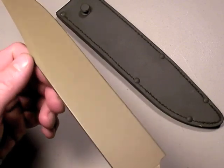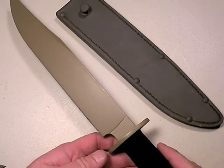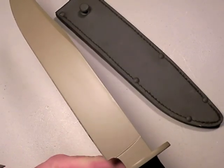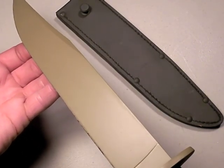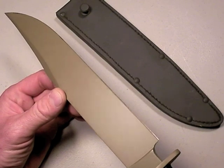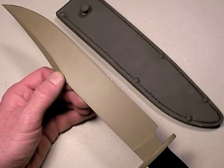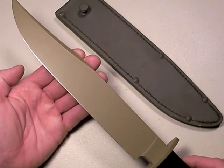The reason I coated this blade - getting back to why didn't you just leave it as is - the POU on this is a soldier's blade, something subdued. I want something more durable. When you get a non-stainless blade like the SK-5, under hard use it will discolor, and it probably will rust in a high humidity environment despite your best efforts. When you apply a finish like Dura-Coat, you alleviate a lot of those concerns. And as from the factory, it seems Cold Steel currently is doing several blades with no coating whatsoever - the SK-5 Trail Master is not coated anymore. Some guys don't care. I care.